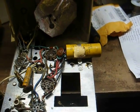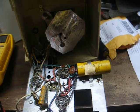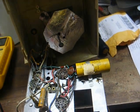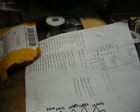There are several ways I could go about finding the open tube filament. The first and easiest way would be to pull each tube and test them on a tube tester — not only could I test for filament continuity, I could test the quality of the tube. But what if you're a newbie who doesn't have a tube tester? Well, you're still in luck. I've drawn out the filament string of this radio. The filament string in most radios without a power transformer is wired in series, just like an old string of Christmas tree lights. If one bulb burns out, none of the bulbs will light — the same for a series-string radio. When one tube filament opens, you get absolutely nothing.